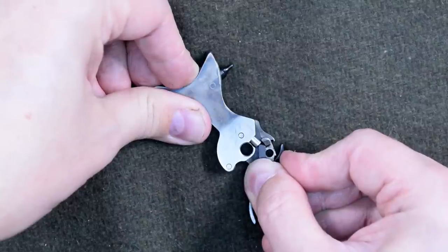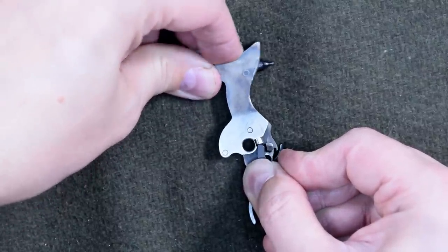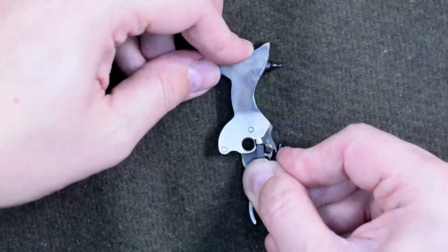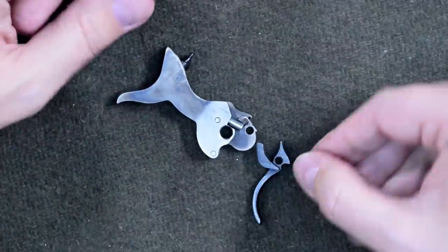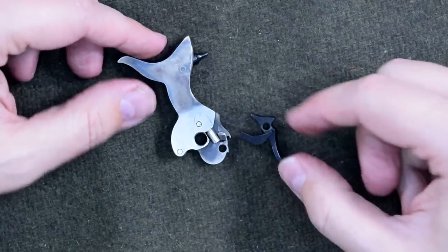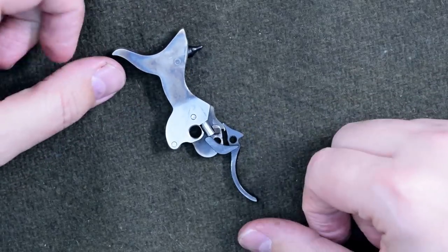and therefore it's going to be rigid. So in other words, the only way that the firing pin can reach the primer on fire, see, hammer comes down, boom, look at that nice alignment there, see how deeply it's pushed it? That's the only time that you're going to be able to have this rigid enough to actually set off the gun. It's actually a really cool little system, although, boy, that's a lot of extra fitment and spring and everything else going in there. That's pretty cool. I wonder what Colt would have thought of it.